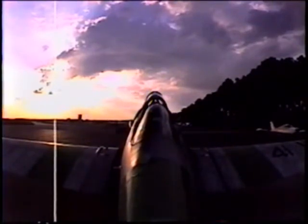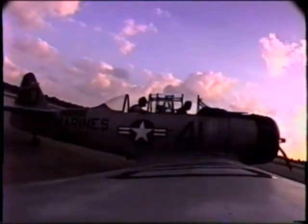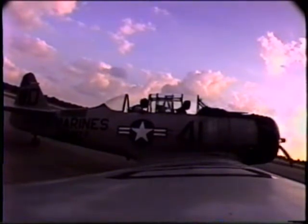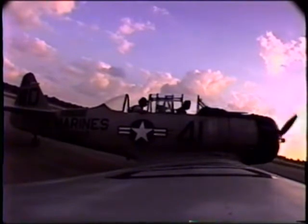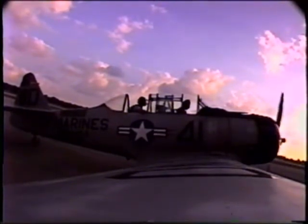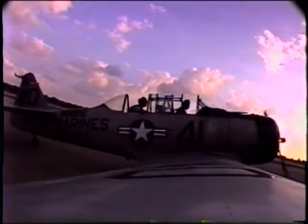Go ahead and pull the stick all the way back into your belly and hold it there for the run. We'll go through the quick engine runup here. We go up to 1,600 for the prop check. Constant speed prop, just like a 182 or a Bonanza would have. This one has no pneumatic charge though — it's just counterweights and oil pressure, that's all that controls it. Built by Hamilton Standard, it's nine feet in diameter — a big, big wheel up there. Probably the biggest prop you can turn on a direct-drive engine. There's no gear reduction in this engine at all. At nine feet and 2,175 RPM, the prop tips start to go supersonic.